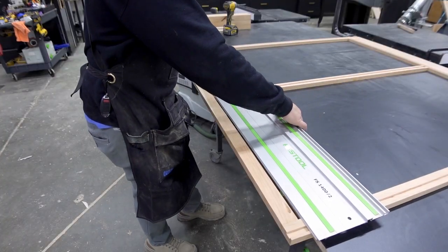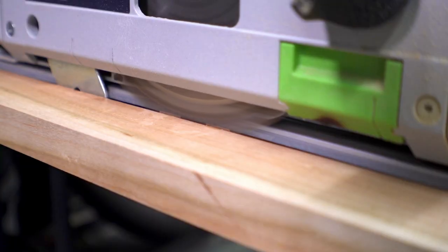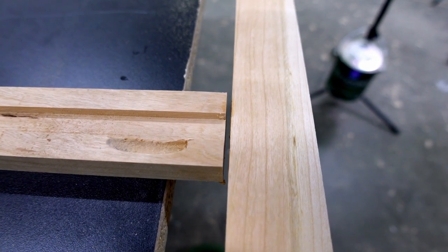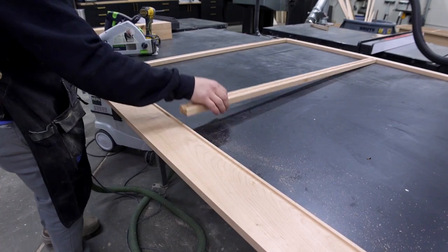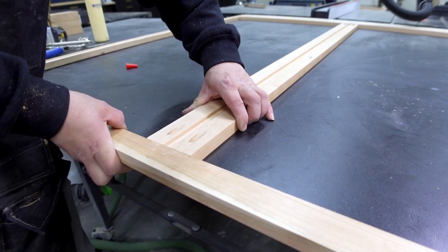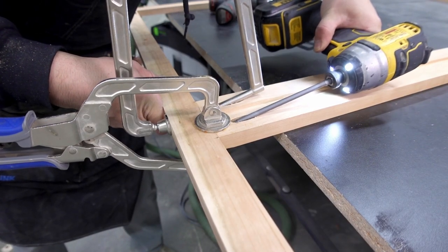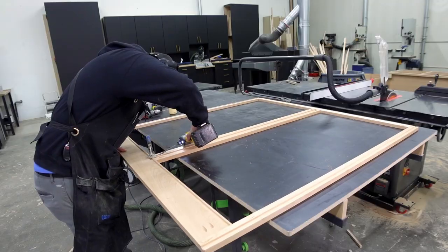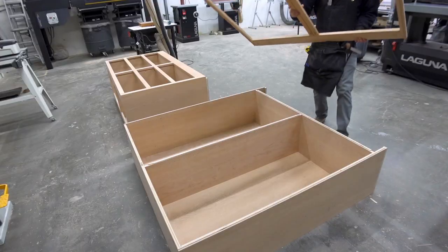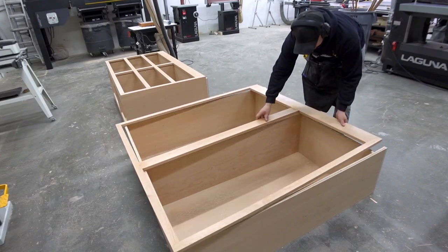Luckily, the fix is pretty simple thanks to this lovely tool that every woodworker really should own. A quick and easy cut with a track saw on either side gets rid of the wrong stile. Then the wider one can be slipped into place and pocket hole screwed from the back side. Now, thankfully, we can all sleep at night.